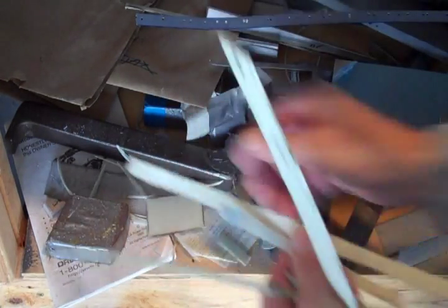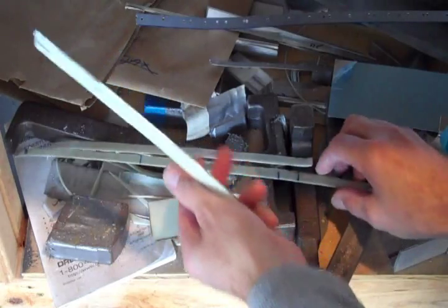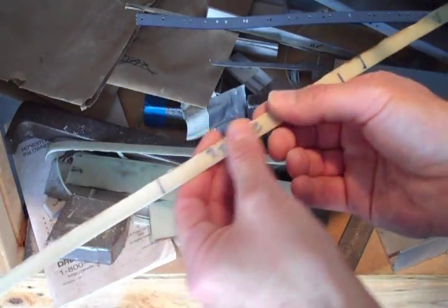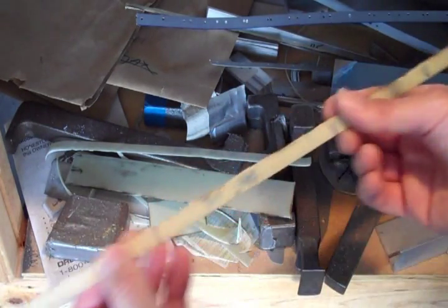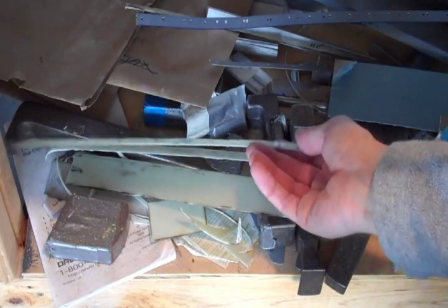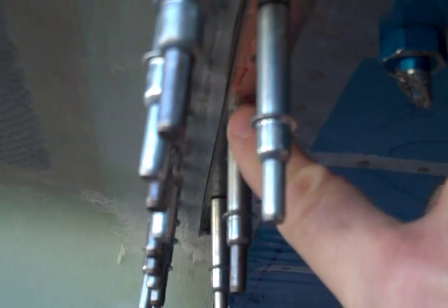This is a piece around the corner of the front — extra piece on the nose gear. Because you can put fiberglass back, I saved all these pieces so that I could just duct tape it back, put some epoxy in, put some cloth over it, and cut it again if I wasn't happy with it. I'm glad I did that because that worked out pretty well.